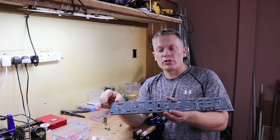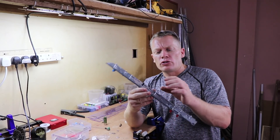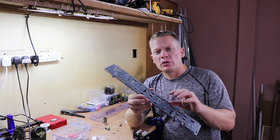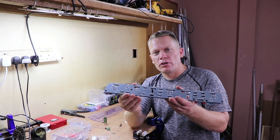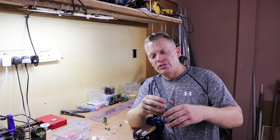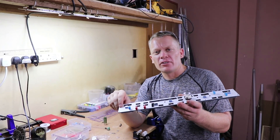The push buttons just here, here, and here — on Fusion I've placed them, so it's just a simple case of drilling through now. Joe's given me this perspex panel and it's very fragile — the whole reason I created a backplate is because it's already got so many cracks in it. I'm having to be very careful. The backplate should hopefully support the faceplate and prevent it cracking anymore. It's just a matter of turning it around and drilling through the holes backwards since they're all pre-lined up.